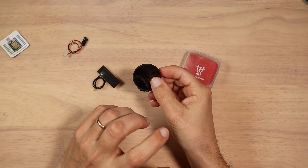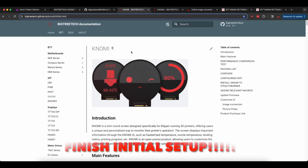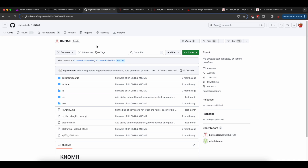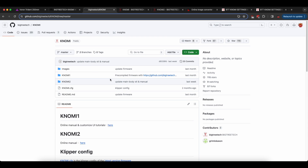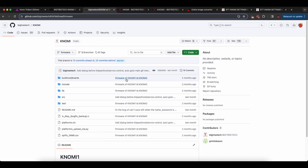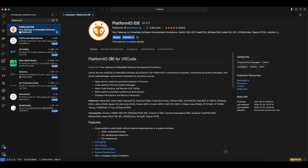Let's move over to my computer. I will describe how to set up custom animations and change colors of the original GIF files. Before we start, you need to read the documentation for Knomi 1 and Knomi 2 — you will need the link for the BIGTREETECH Knomi GitHub repository, and I will share all the links in the description. The master branch has pre-built, pre-compiled firmware, documentation, and STL files, but the firmware source code is what we'll need in order to customize the Knomi. To start, you want to install Visual Studio Code and add the PlatformIO IDE plugin. This plugin with VS Code will automatically assemble our developer environment and get us up to speed as fast as possible.